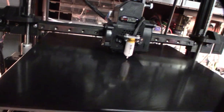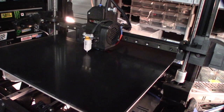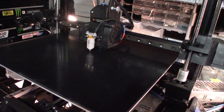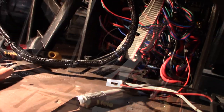That's how you crack a bed — a glass bed. There's something going on with the servo. I'm assuming it has to do with the end stop. The stall guard end stop is somehow interfering. Maybe in Marlin I need to configure the pin, because it's no longer using the standard Z pin — there's a dedicated pin now.